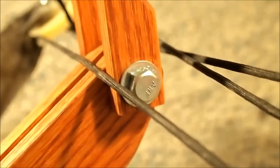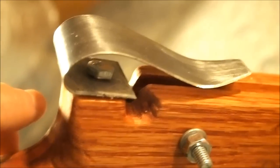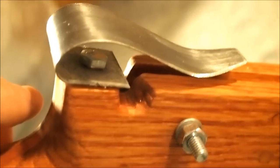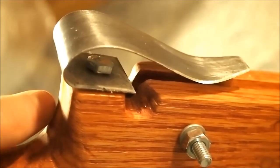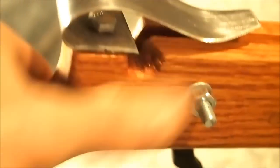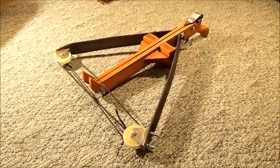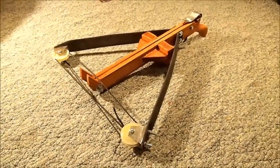The string stops are as simple as they look — just two more pieces of oak bolted on with a three-eighths-inch bolt, a couple of washers, and a nut on the other end. The spring on the back is just regular 18-gauge steel — not spring steel, it doesn't have to be. I just bolted it on after cutting it out and bending it into shape. Here's how it looks uncocked, and here's how it looks cocked.